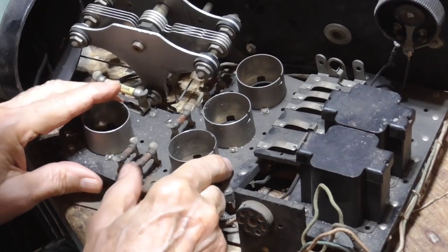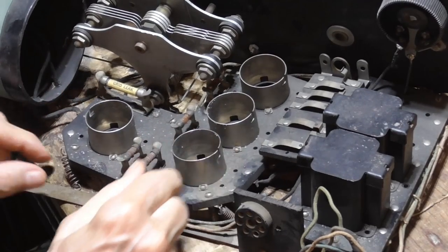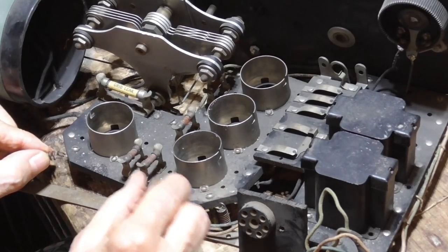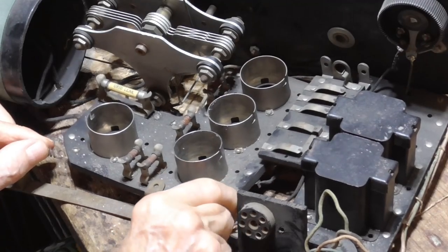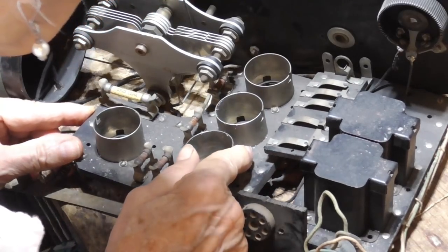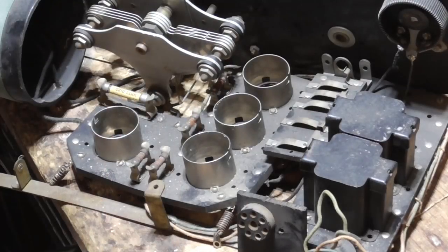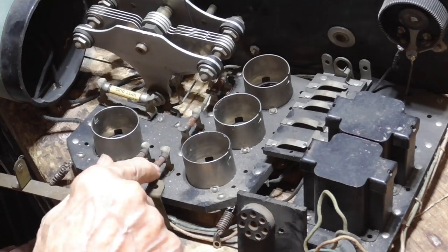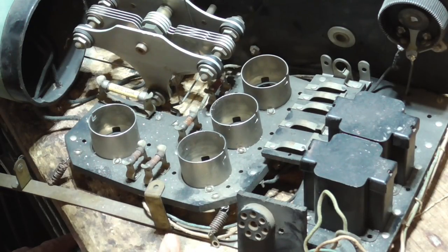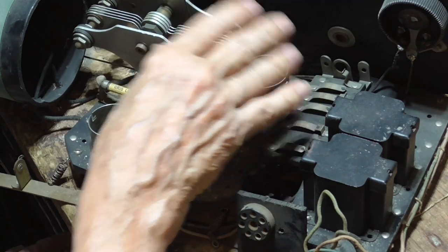The radio tube plate here was hung on springs. There were sets of springs here that were connected to these various places, and that held that floating, so it's kind of floating in the air. And that, of course, got completely bollocksed when the radio got thrown in the shipping. So we've got all the little resistors are there. They have little resistors here that are in the filament circuit. They are all present. Grid leak is present. That's good. It's just that that cam is the one item.